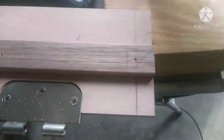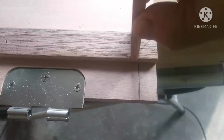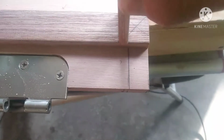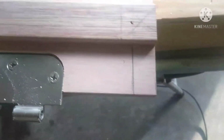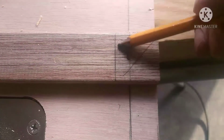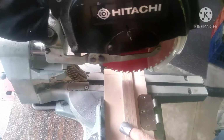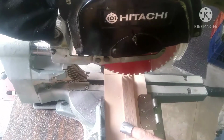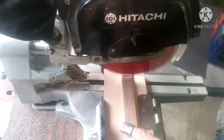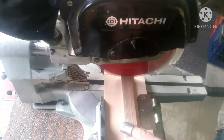Piece of scrap just to mark where my jamb is going. It's good to have reference marks here. I need to trim just the door stop down a little bit so that the head piece will fit right in there. I won't have to wrestle with it. So get that marked, and then we'll cut that little square off each side and pop that out. I'm going to use my chop box here. It's okay if you overcut just a fuzz, especially with this one.